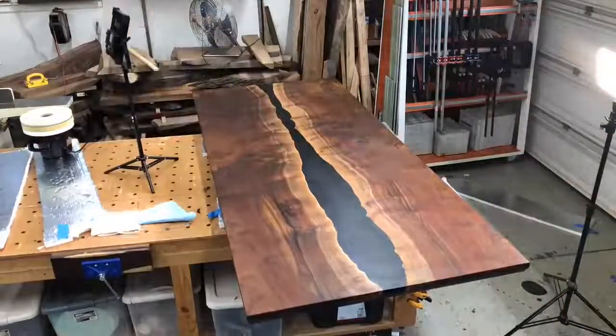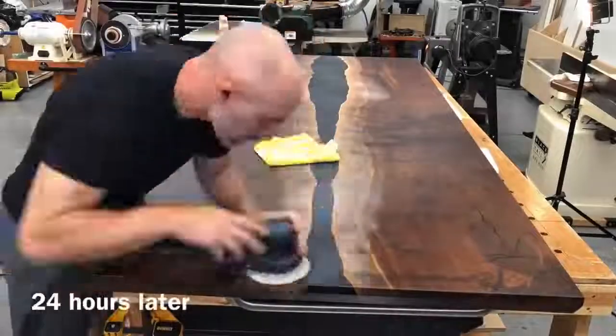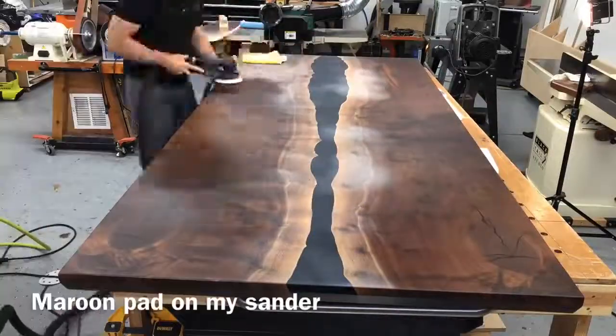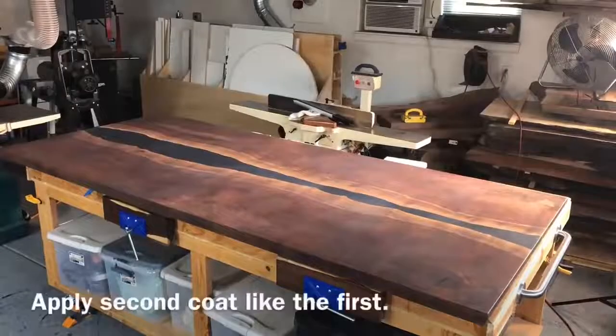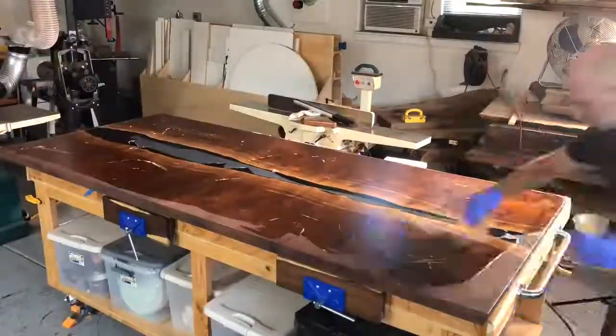There are some specific steps if you decide to add a second coat of Rubio Monocoat, because they recommend it as a single coat finish. However, I found I can get a little more sheen and better protection with a second coat — you just need to follow the steps in my blog or my finishing video. This video is not sponsored by Rubio, although I feel like it should be.